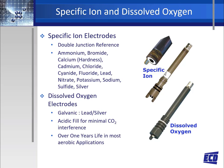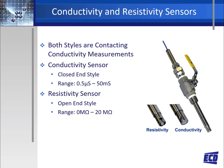The galvanic dissolved oxygen electrode offers a lead anode and silver cathode with an acetic fill solution to minimize CO2 interference and maximize process life. Typical life in most aerobic applications exceeds one year. Contacting conductivity and resistivity gives the customer the flexibility to select the correct technology for the application and the measurement range requirements. The contacting conductivity is a closed construction style sensor offering auto-ranging capabilities used for the measurement range of 0 to 50 millisiemens or 50,000 microsiemens. The resistivity sensor is an open construction style used in ultra-pure water applications with a range of 0 to 20 megaohms.